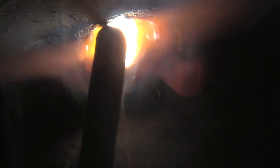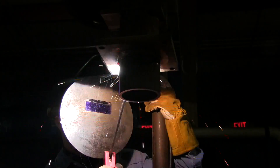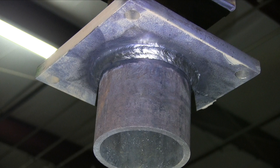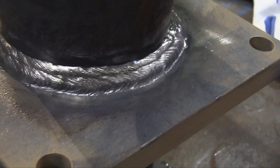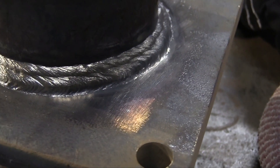Notice Andrew is working the rod just a little bit, and that is just to help the bead flatten out a little bit — to prevent it from being too crowned up and also to fill in that little valley that you're always going to have on the last bead of a three-pass fillet weld, whether it's overhead, horizontal, or flat. After wire brushing it looks pretty nice. I'd call that pretty good for overhead 5/32.